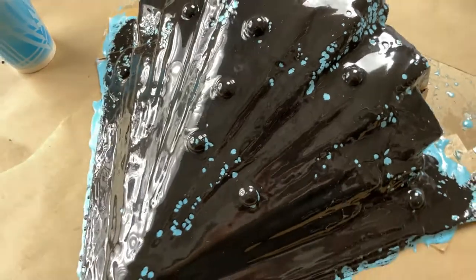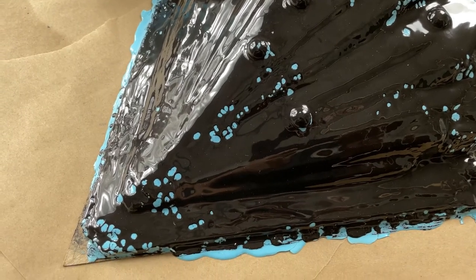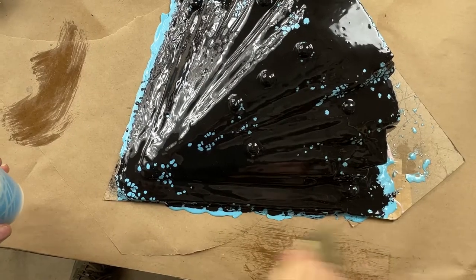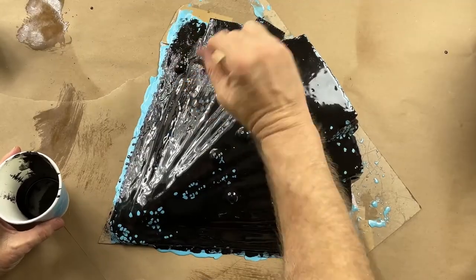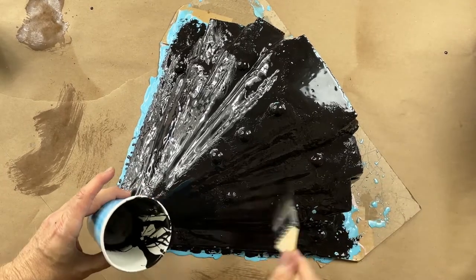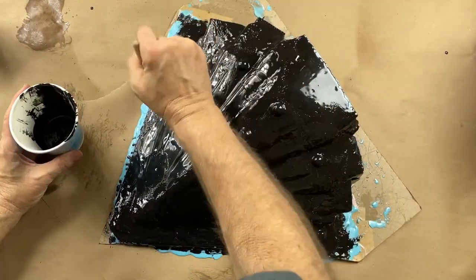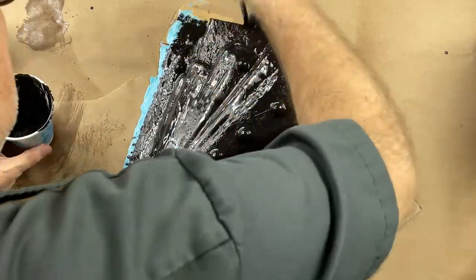All things considered, the holidays are actually a good thing because it means the silicone release is doing its job and the epoxy is not going to want to stick to the rubber. Let's get the acetone out of the brush and double coat these holidays — usually the second coat takes care of the vast majority of them. They really don't hurt anything. These are just mold cases, not car bodies, so if there are little holidays in the gel coat no one's going to care, and it's not going to hurt the function of the mold at all.